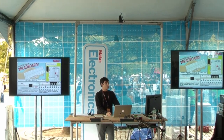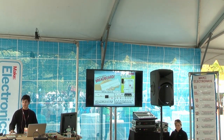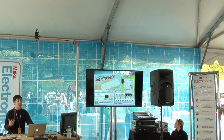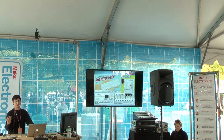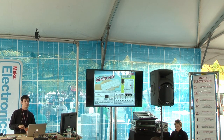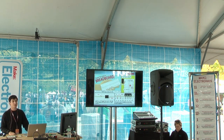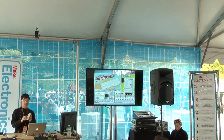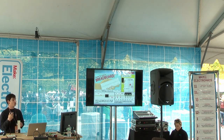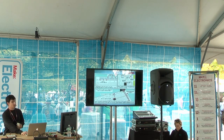This illustration shows the basics of breadboarding. The breadboard comes in various sizes, it's usually plastic, and you don't need soldering at all. You have rails — you plug in your power supply, whether that's a battery or a DC power jack, and that provides power to the board. From those connections you connect jumper wires or other components, and they pull power from the terminal connections. In the bottom left is an IC — an integrated circuit, like a 555 timer chip. In the middle of the board there's a deep trench, which is an actual physical disconnection — no connection between the two sides.